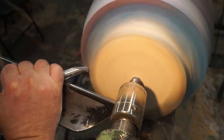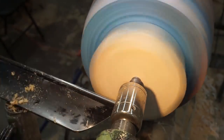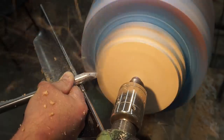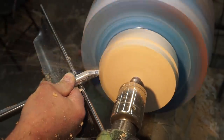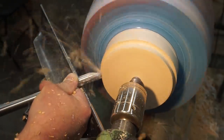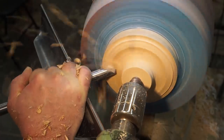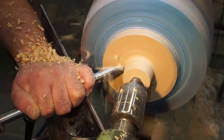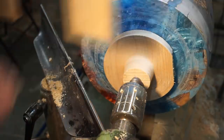I put that piece in the pressure pot as well. I wasn't in a huge hurry so I figured I would turn it the next day. Here I'm just using the gouge to turn down what's going to be the waste block - it's a piece of hard maple so it's a good candidate for that. I originally had a large foot on the base of this, but I thought it was going to interfere with my design so I figured I would turn it down so the small jaws from my Stronghold chuck could hold it.